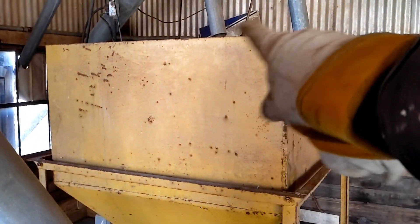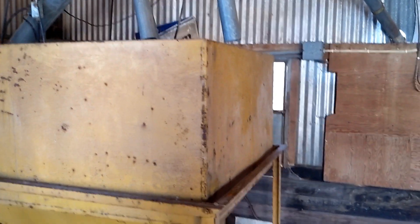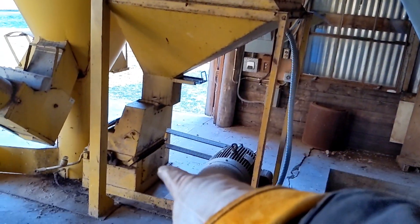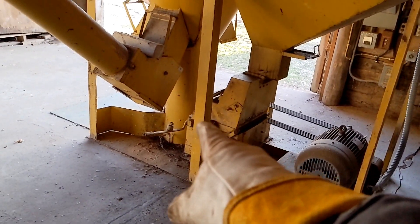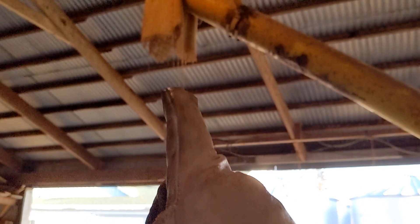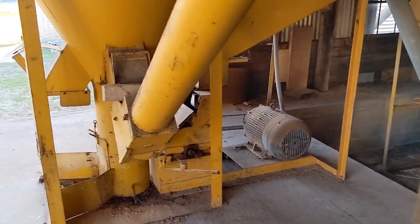You would put in your product here — 200 pounds of beans, 100 pounds of corn, whatever — and you would come up with 300 pounds. Then that would get augered up into the hammer mill right here. The hammer mill would discharge into the mixer. You would do your mix, put your additives in, and then you would pump it out the auger into your wagon and go feed your turkeys or horses or whatever. It's kind of interesting.